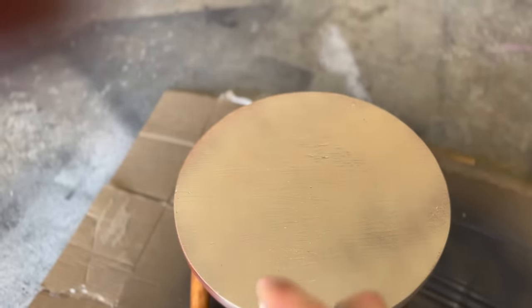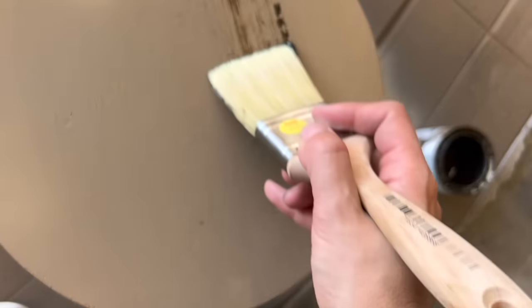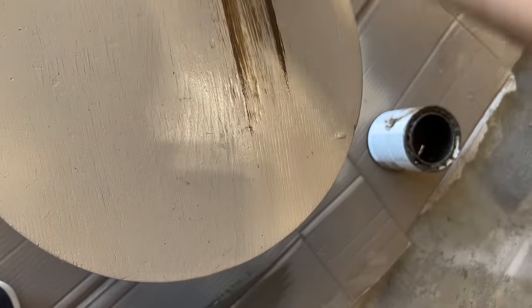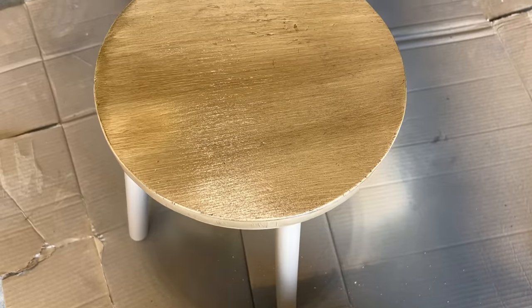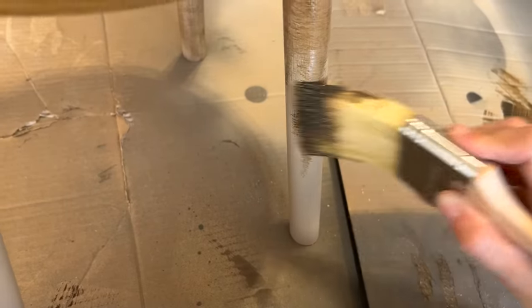After neutralizing the overall color, I'm going to go in with an antiquing wax. This one is by Krylon, and I really like it. I'm going to use a bristled brush to kind of go in the direction that the grain naturally was, so it overall just takes it like a stain. After the wax dries down, it's then just time to seal it. Altogether, this stool only cost me just about $2 because I had all of the other supplies on hand.